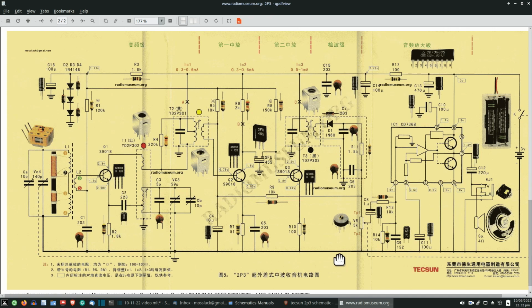And you know me, I don't like doing things like that. I don't know if I mentioned it or not, but Daniel over there, he checked his. His was in the proper range, and here's the ranges for that. I don't know if you saw them. LC1 or whatever that is should be between 0.3 and 0.6. I can't see it. It's in red, and I can't really see that sitting here. Okay, 0.3 to 0.6 milliamp is what it's supposed to be. This LC2 or whatever it is, 0.3 to 0.6, same thing. And this one should be LC3 as 0.5 to 1 milliamp. So that's what they need to be.